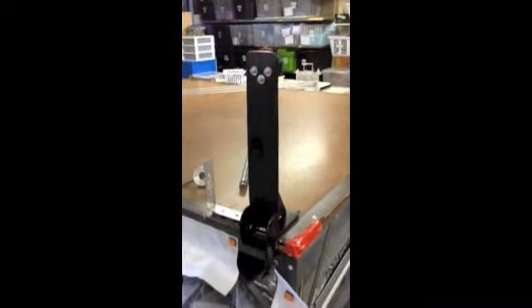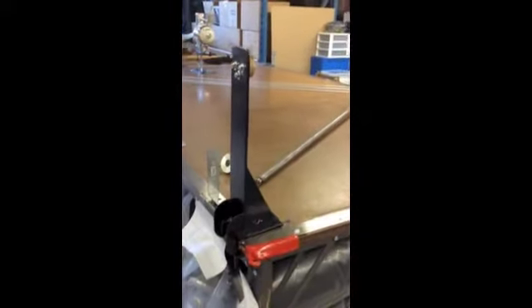What I wanted to explain is how we created our own fabric spreader that we use manually. Two brackets are designed to clamp onto the edge of the cutting table, and up above there is a slot that accommodates a bar. The two cones — one on each end — are completely adjustable so we can put the bar through the roll of fabric and make it snug enough that the fabric pulls off the roll very easily.